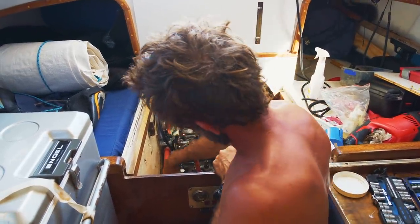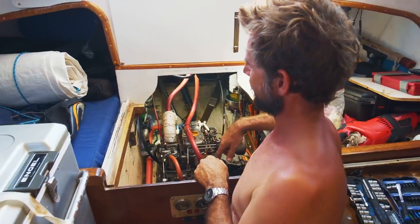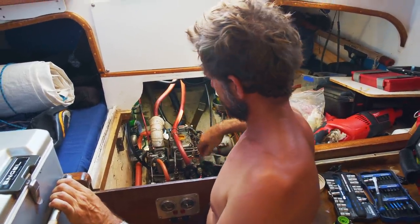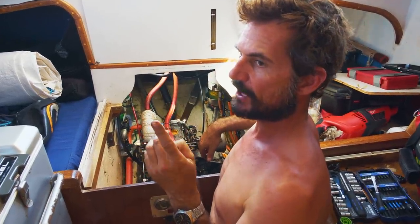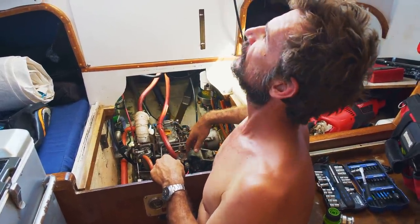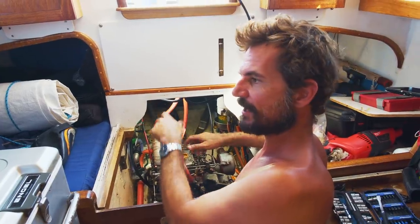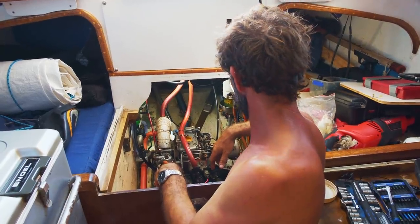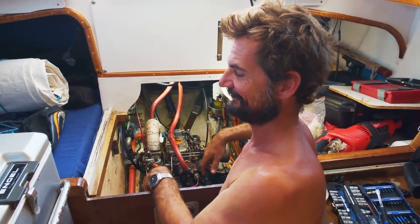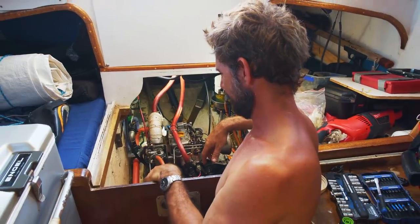We're also waiting here for something because we want to do those engine mounts. We had some metric M12 — so almost half-inch — studs that the engine sits on, and the two front ones have sheared. What we're going to do is get a bunch of rags, put one of the dinghy seats across here as a strongback, put a come-along — a little lever block — and lift the engine up off its mounts, replace those, put it back on, and then go to the Montebellos! I make it sound easy. Got that to look forward to for the next couple of days. Got to go collect the parts from the post office first. Never leave home without a way of lifting your engine up and down — that's my motto.